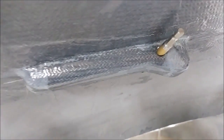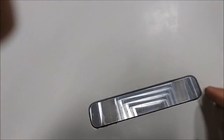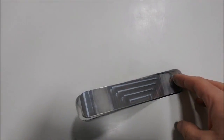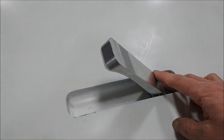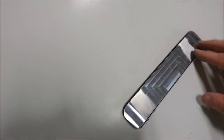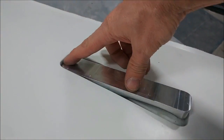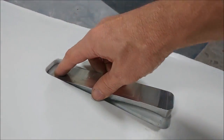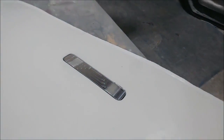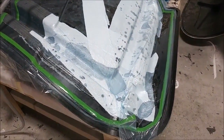We've got those door handles, and decided not to create a jig — just sort of do this by hand. I basically lined up where those holes needed to be. You can see I've got a drill bit in there because I don't have a bolt or a pin for that right now. You can see the action's working nicely. We have to bond some bushings in the back side so we have a way of fixing that to the inside of the door frame permanently, but right now it's just held in with the drill bit and it seems to be working fine.